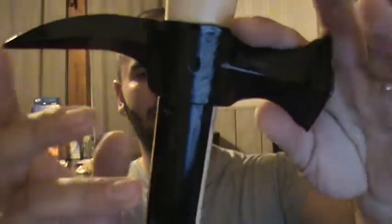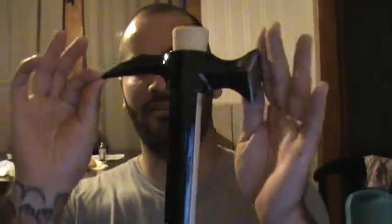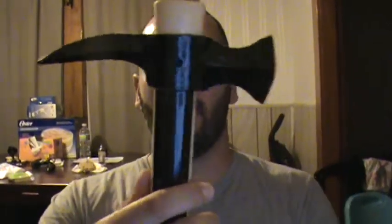The metal of the Warhammer is 5150 steel. The face is one and a half inches by one and seven-eighths inches. The 5150 steel is heat treated differently — the face and tip of the spike versus the rest of the body. The face of the hammer is very, very beautifully polished — I am going to mess that up.